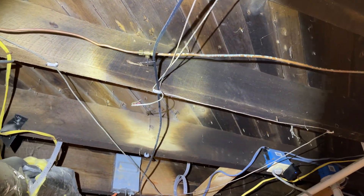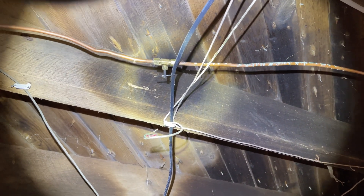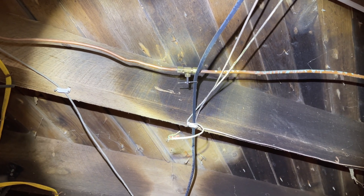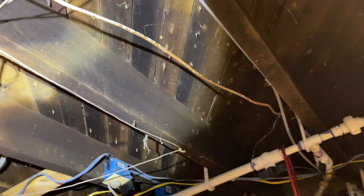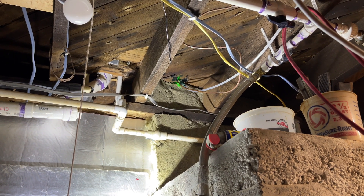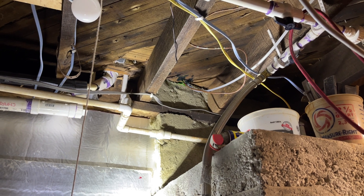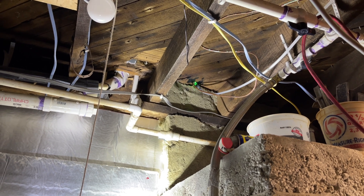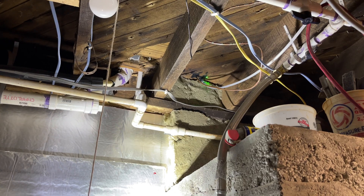To connect it to the RO unit, I disconnected that and ran the tubing up and over towards the sink where the RO system is. If you look closely, you can see a valve right there — I used that as a coupler to add the extra copper tube and it also provides a shutoff. If you see something that looks like corrosion on the tube, that's because I disinfected all the copper tube and fittings in Clorox to make sure there was nothing in it. That's where the copper tubing goes through the floor up under the sink to the RO system. I sealed all the holes I drilled with some caulking.